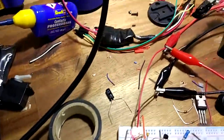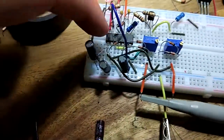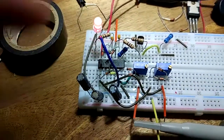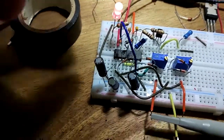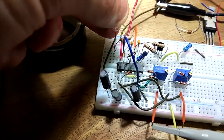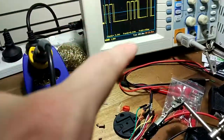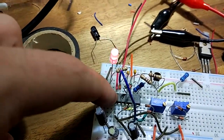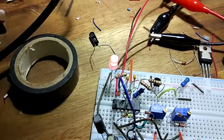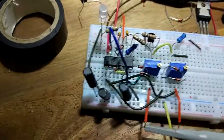I had a spare Schmitt trigger, because I'm only using 5 to actually complete the generation of the sound, of the waveform. So I had a spare one, which I am passing that signal, inverting it in one of the Schmitt triggers, and then outputting it through this LED. And the output stage